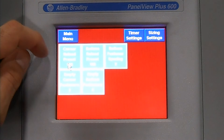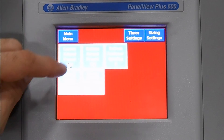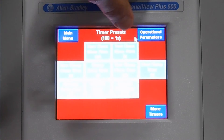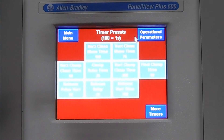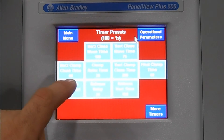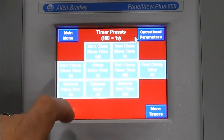In your settings, we can set the number of counters for the corner tool reloads, bottom fastener spacing, as well as when the tools are empty. We've also got timer settings available — how long does the machine allow each operation to happen in the sequence before we move on? We've got our horizontal close timer, vertical close, horizontal clamp, vertical clamp, release delay, and our final clamp time.